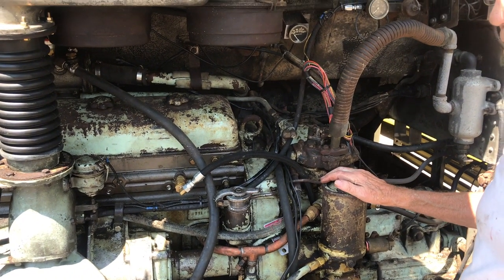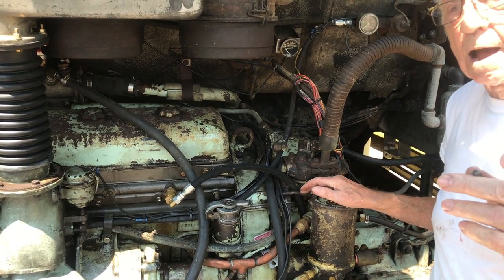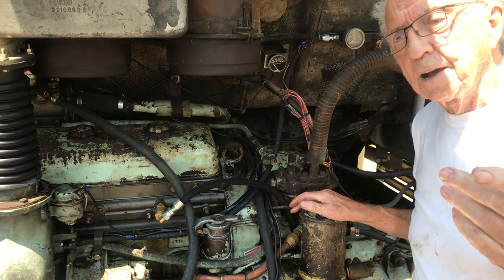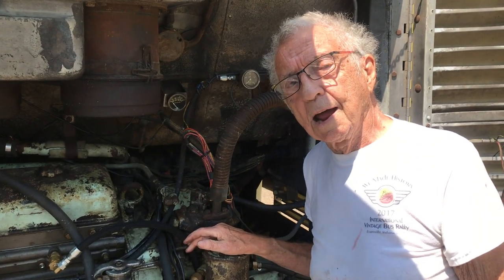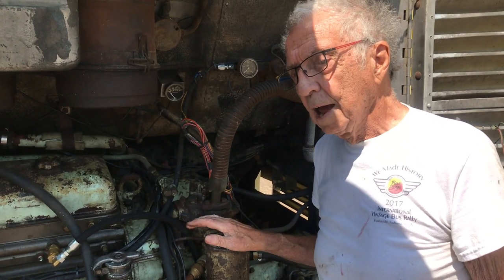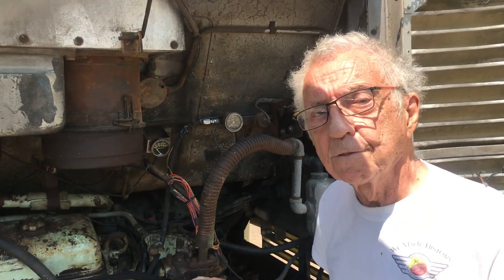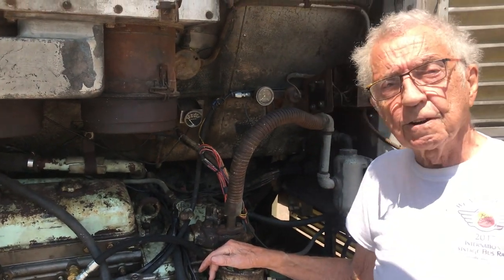Then, what was I talking about? Fuel leaks. Oh, yeah. Then there's a little piece here on how I look for fuel leaks. Because if you get your engine running and it's running crappy and you don't know why, and you say, well, I got everything timed right, the injectors are all good, it's because you have suction leaks in the fuel system. So I put a little bit of that in, how I handle that issue. And Glenn was here, so we got that on camera. So I think that covers everything now.